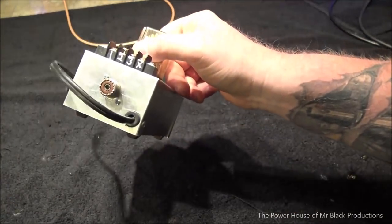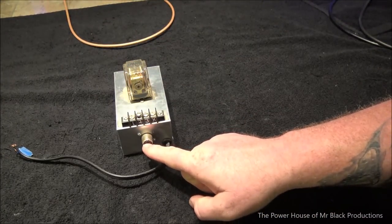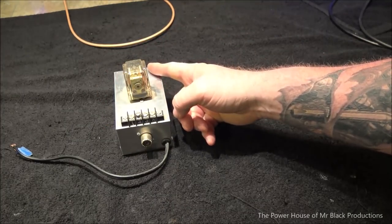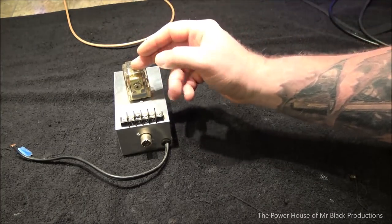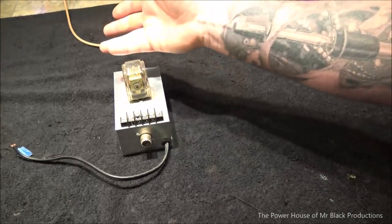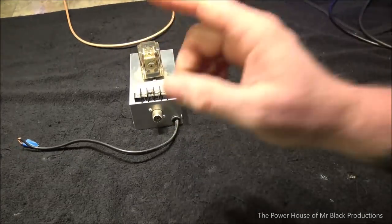So like one coax, two coaxes, okay? All this does is it takes the access to the antenna and says, you're going to go to this coax or you're going to go to this coax. And depending on what you're doing with it, if you're in transmit or if you're in receive, when the relay's in the relaxed position where the coil's not charged, you're going to have it in the receive position. So as soon as you grab the microphone and fire down, it's going to go click and click it over. Okay, so